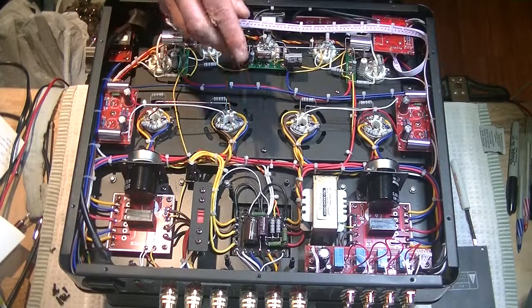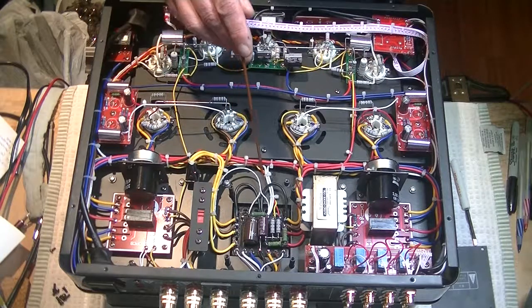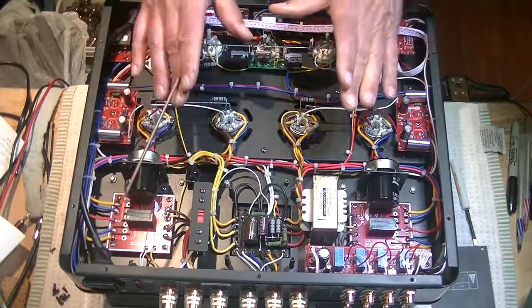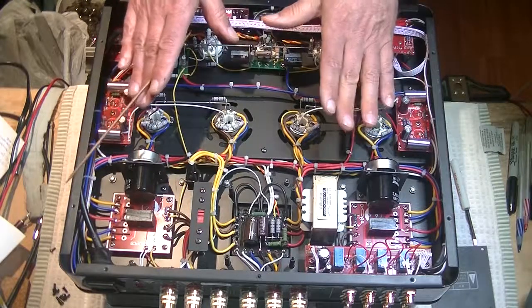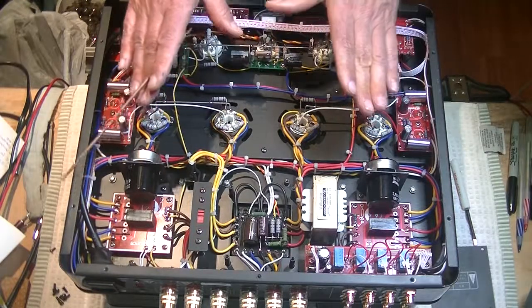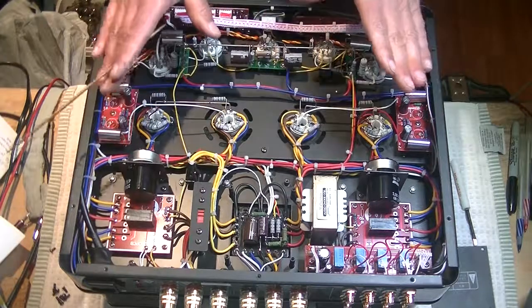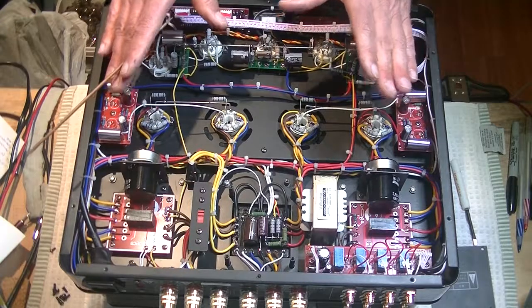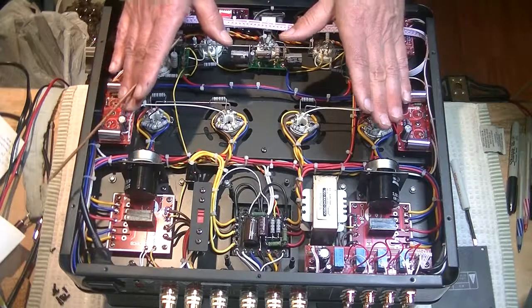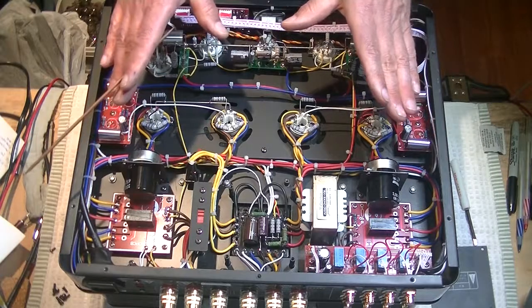That AC voltage is rectified, which basically means that we make DC out of it. The DC is what we run virtually all of our amplifiers on. AC is what we put the audio onto our amplifiers on for amplification. And the beauty of amplifiers is that the AC audio signal can ride on top of the DC in the right circuit topology. Isn't that neat?